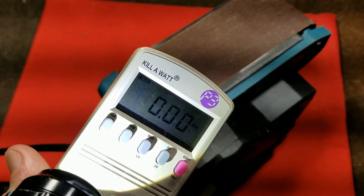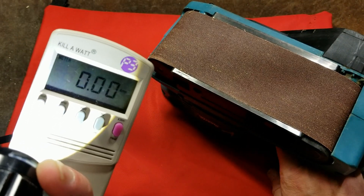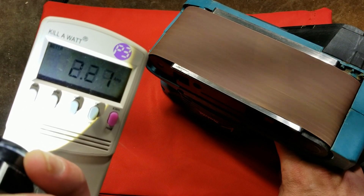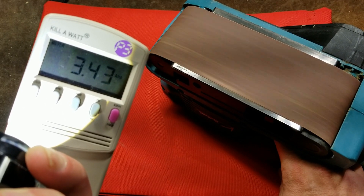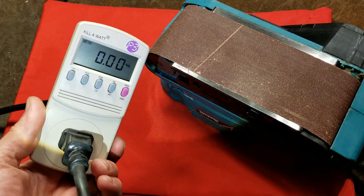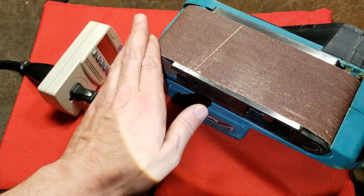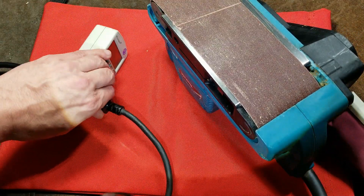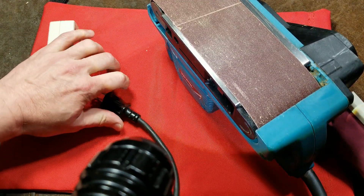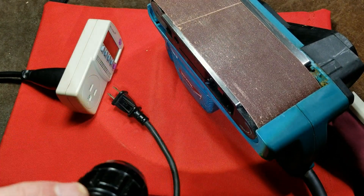There we go — I'll move this around so I can access the trigger. This is really awkward; probably should use a different tool. What we could see is that I was hitting three and a half to four amps just freewheeling, which tells you how much losses there really are in a belt sander — that's pulling a lot of juice just to run a belt freewheeling. But it also tells you how much overhead you have before you start running into the actual current limit.